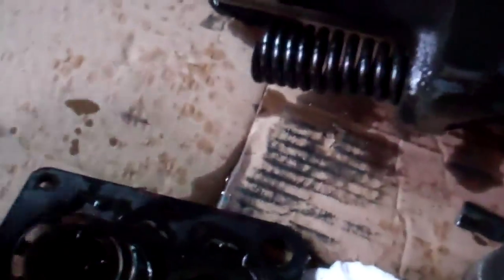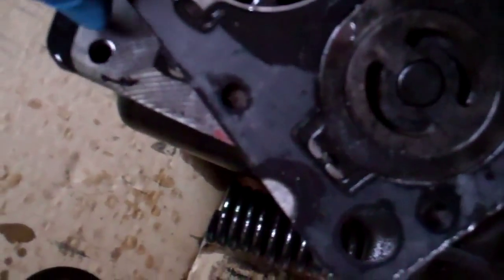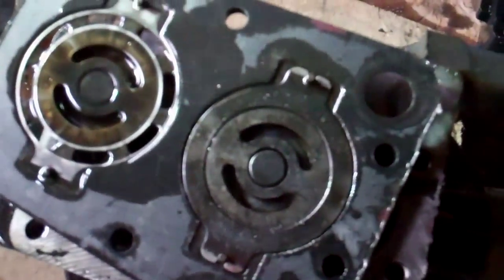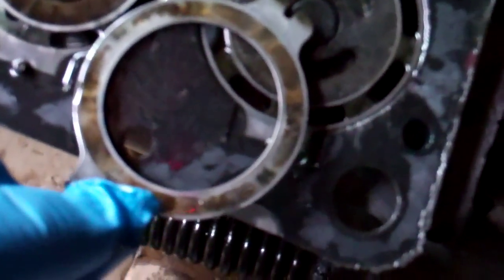Something hit me on the shoe — might have been one of these little pins. So that's a suction reed from the good cylinder; it looks a lot more gritty and pitted looking. The bad one — none of that — so it doesn't look too bad.